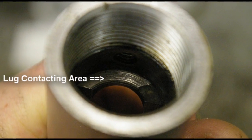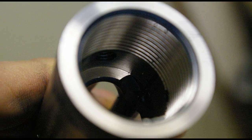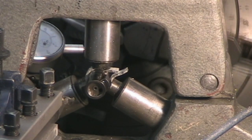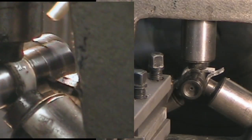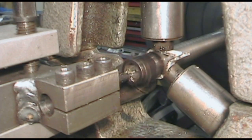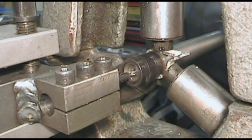The last thing he touches on the receiver is the bolt lug area. Here's before and after the receiver has been trued up — the use of sharp and well-maintained cutting tools has really cleaned up this entire area. Next, he moves on to the bolt itself. The first step is to center the bolt in the lathe, measuring in multiple positions to ensure less than one thousandth of an inch run out. A small amount of metal is trimmed off the rear surface of the bolt lugs. He then gives the front of the bolt a facelift. These contact surfaces are now square and true to the center line of the bolt.